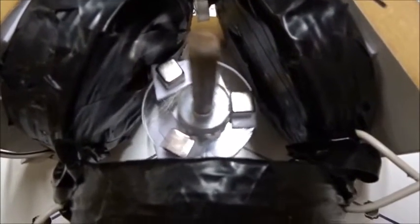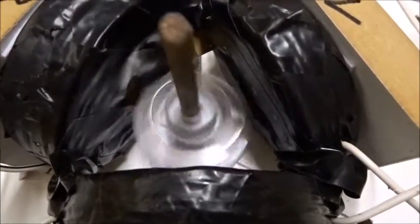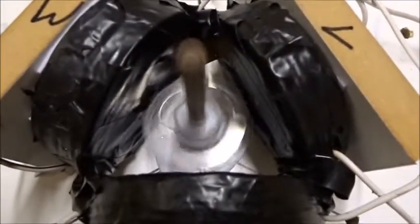If you put three magnets on the rotor with all the end poles out like six, they just rattle and don't do anything. You need two or four to make it spin. The easiest solution is to put two magnets arranged as a bar magnet across the middle, and then it spins up quite easily. That's the Tesla Rotating Magnetic Field — three coils: U, V, W.